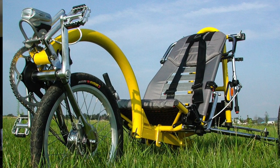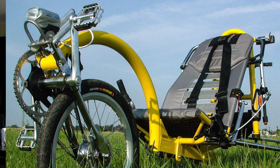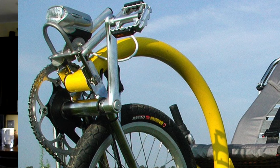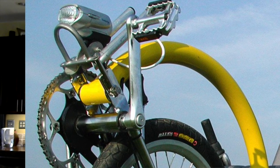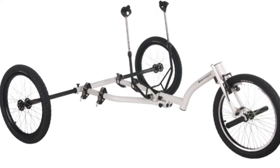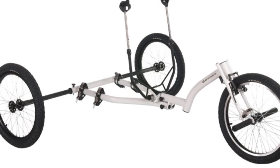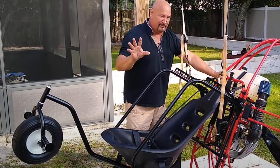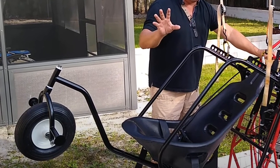The Flike, which is an obsolete offering from Fresh Breeze, influenced my design pretty heavily, although I didn't like the bicycle chain drive system because it was extra weight I didn't need. I looked at the Air One design — another open wheel, high center of gravity type machine. What I didn't like about the Air One design was their method of swing arm support prior to takeoff and the fact that it wasn't a true weight shift machine.